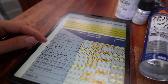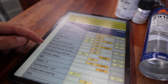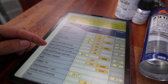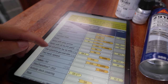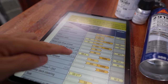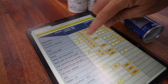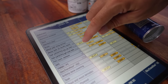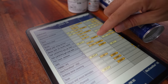In this example we have two different materials: stainless steel — that's the chain plate — and also some fiberglass. Well, technically it's thickened epoxy with some filler and chopped fiberglass in it, but I think the closest thing we'll find on the list is just fiberglass on the layup side. For the stainless steel we need to lightly abrade the surface and then use the 205 activator, while for the fiberglass we need to sand the surface using 60 to 80 grit and then apply the multi-primer.